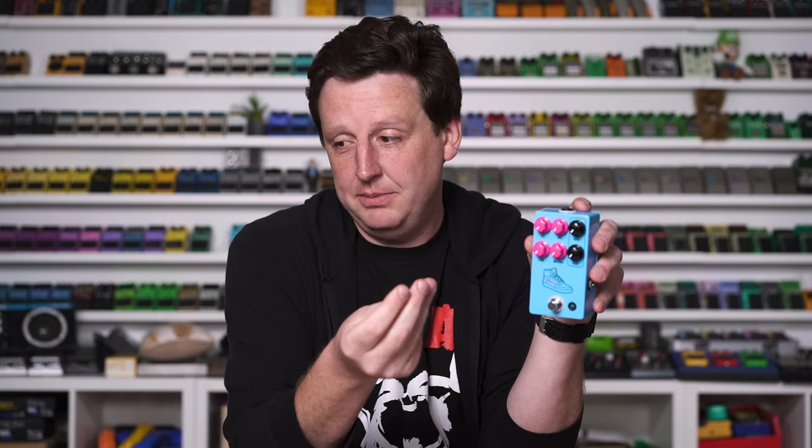And what ended up happening from this, I remember on the original breadboard being completely blown away at how versatile this pedal is, because these two circuits combined, having an active mid EQ range, pre-distortion or overdrive, it's crazy because most all overdrive pedals really are the same type of overdrive, the way they clip a waveform. And what sets things apart is the little minute differences in tone controls, input filtering, output filtering. And so when you have this much power in an EQ before that powerful and amp-like overdrive distortion circuit, it's incredibly versatile. So that's how this works.